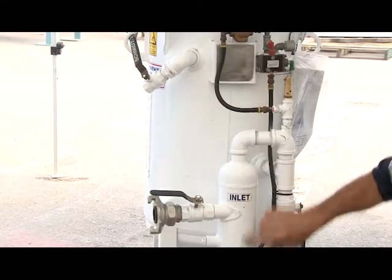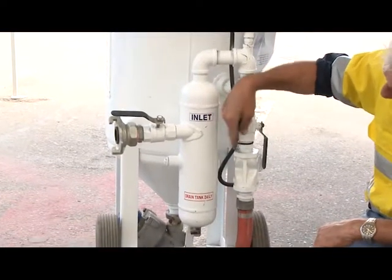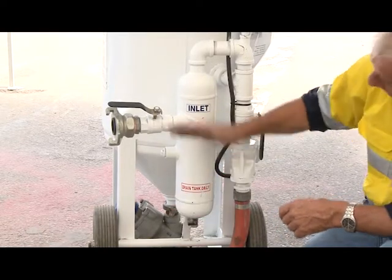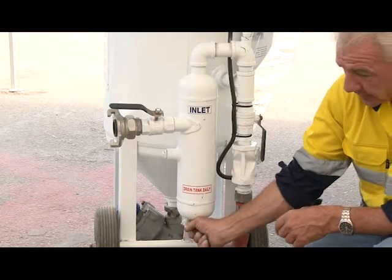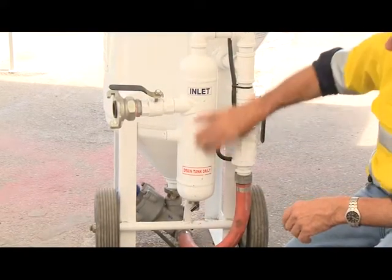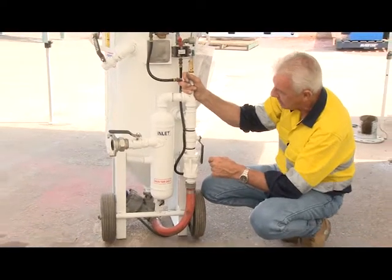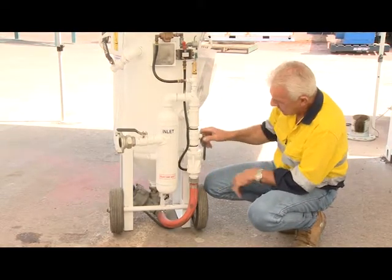Now with all these blast pots that have got this moisture separator on there, it's just a pressurised bowl. There will be air coming in and spinning through this, which will flick the moisture to the outside of it. If you have an after cooler in line, you'll find that any moisture will be significantly reduced or diminished. However, even with an after cooler or an air prep on this particular air supply line, I'll only crack the quarter inch tap minutely. With it cracked, it enables the moisture and the air to weep out through the bottom, so there can't be any moisture accumulation come through the pot. Remember, moisture as far as abrasive blasting is concerned is your biggest enemy. It will corrode the inside of the pot and undermine all of these particular valves and reduce their longevity.